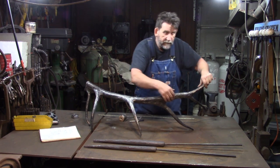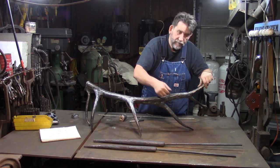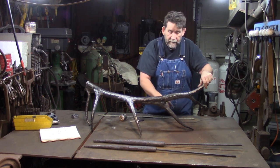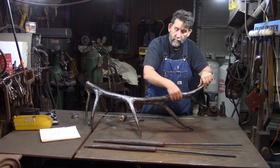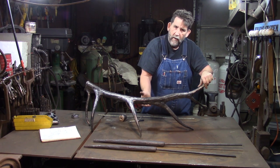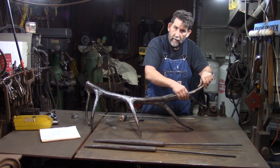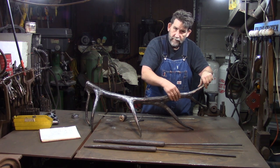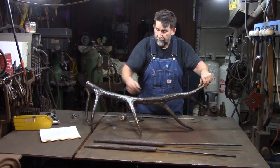Now up here where this is thicker, I ended up taking a piece of a 5/16 rod and laying it along the inside here and welding that up in there to build that up wider here or here. Okay, so this is thicker, and since that tapered, I went ahead and I just built that up with weld. Here, I put some filler rod in there, a piece of 5/16, and then I welded it up to get our girth here and our girth here, okay?